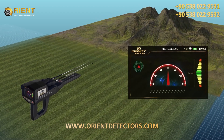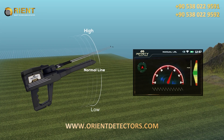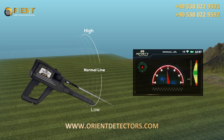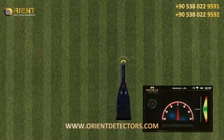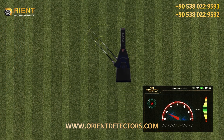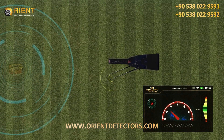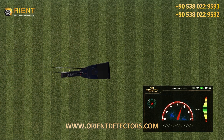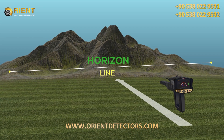The alignment tool is a color-graded indicator from top to bottom; the zero point in the middle expresses the angle of inclination of the device from the horizon, and the correct values are shown in green. During the scanning process, the antennas will move left and right according to the target being detected. The user should change direction according to the direction of the antennas, following the movement of the indicator arrow to get the correct direction, while keeping the device in a correct position with respect to the horizon.